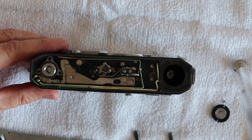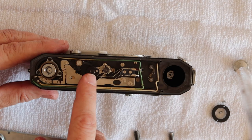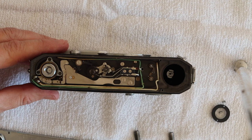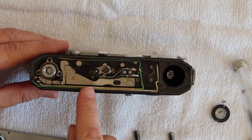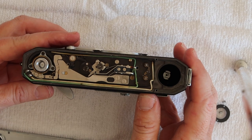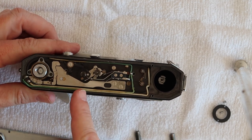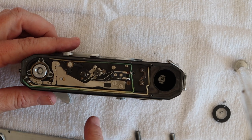With the bottom cover off, we can see the tripod socket. The big silver piece of metal is the return spring for the shutter button. We have an intermediary shaft, the mechanism for the flash sync, and on the right side are the tension adjusters for the shutter curtains. The main culprit behind the sticking shutter is this intermediary gear — when the shutter is fired, this post or dowel should end up in the six o'clock position. Often it's a little off to the side, and when that happens the trailing curtain is not closed all the way.